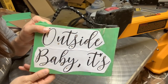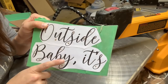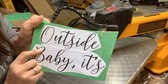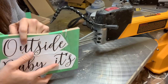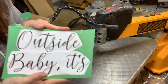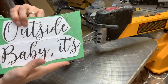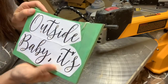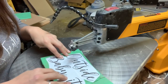We've prepped this section for cutting. I've drilled the pilot holes for all of the interior cuts, and I've also drilled one pilot hole to do the exterior cuts. As I've mentioned previously, you don't want to be cutting in from the outside because that will create instability in your board. When you have the board intact and you're cutting out everything inside, you don't have to worry about bracing — it will be stable within the material.